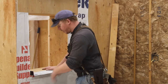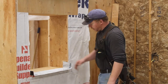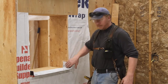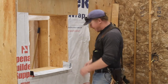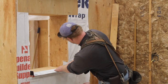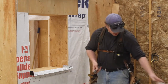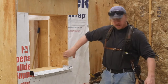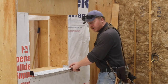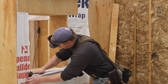Figure out at the first window what your flashing sizes need to be — you can gang cut all your flashings and it makes the process more efficient. We typically don't want to see the sill flashing go up too much higher than maybe an inch or two; I would say keep it down to an inch. This is a one-off on this video so I cut it a little long — ideally we'd be at about one inch. The literature always wants you to run your sill flashing up six inches or something like that, but we've seen that stresses the flex wrap joint. We feel it's better to keep that short — it makes for an easier and more durable install.